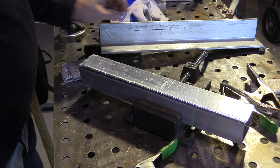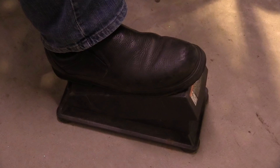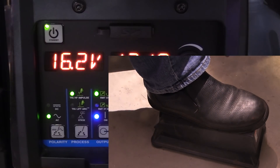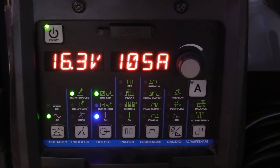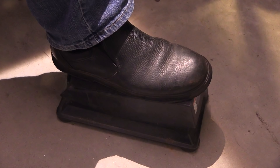Let's take a look at the foot pedal action now. This is a Dynasty 280, using advanced square wave at 151 amps on the panel with a wireless foot pedal. I light up, initiate the arc, try to get a puddle going within about three seconds, and get moving. Once I get it stabilized and the heat about right, there's not a whole lot of foot pedal movement — each little move can go up or down about 10 amps. That's another reason I don't like to set the machine on max, because each tiny movement makes a lot more difference. I set it a little more than what I need, and once I'm on a roll it doesn't move much.